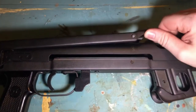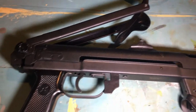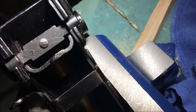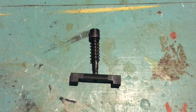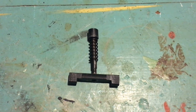Since the pin was the only thing holding the stock in place, after removing it the stock moves freely but it will not lock into place. In the original firearm the pin was put through the latch bar and peened over. I decided to try and preserve the pin as much as possible and cut away at the latch bar and the peened-over portions only, so the pin is altered as little as possible when I extract it. I was able to do this pretty well, then I used a punch to remove the pin and spring.